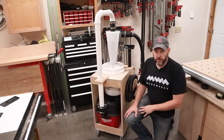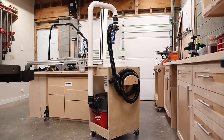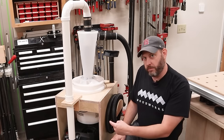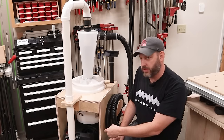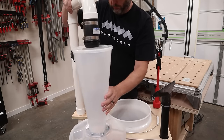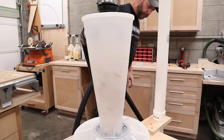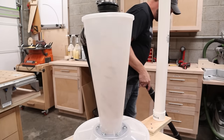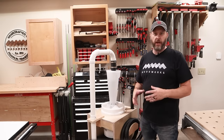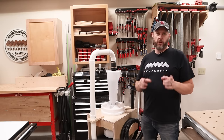Should you spend the extra money for a dust extractor over a shop vac? In my opinion, the only real game-changer feature you get with a dust extractor is the improved air filtration. But I do have an upgrade to show you for your shop vac that'll improve its efficiency and filtration. This is a dust collection cart, and it basically takes any shop vac and turns it into a mini two-stage dust collector. By adding a cyclone like this, I can separate out the dust and debris before it makes it into the vacuum — which is really important because that's where the filter is. If you can keep all that material from clogging up the filter, you're going to keep the vacuum running as efficiently as it can for as long as it can. The cyclone style does the best at separating out fine dust and debris, and that's the style I'd recommend. I also have plans available for this dust collection cart — links are in the description below.